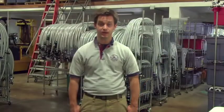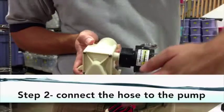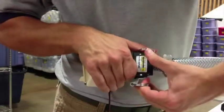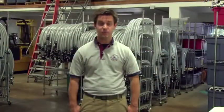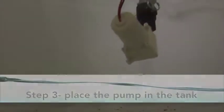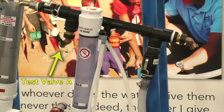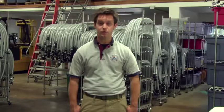Step two: connect the 3/4 inch hose from the heat exchanger to the male adapter on the submersible pump. Step three: the pump is now ready to be placed at the bottom of whatever drum, cistern, or tank is being used. Once it is in the water, open and close test valve A to release any air trapped in the pump. Do not attach the pump cable wires to the battery until you are ready to operate the purifier. Never run the pump unless it is in the water.